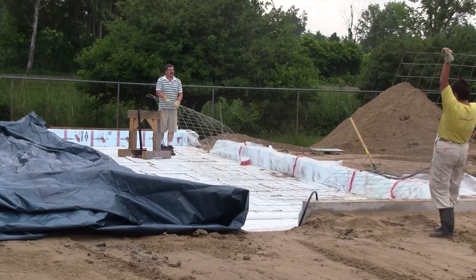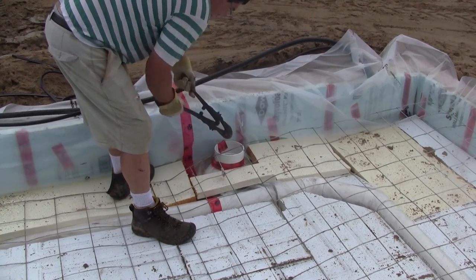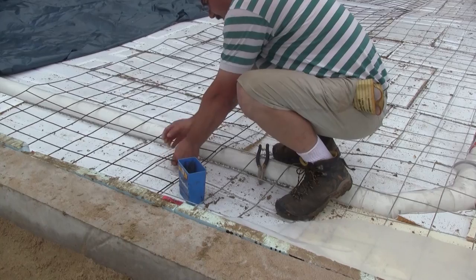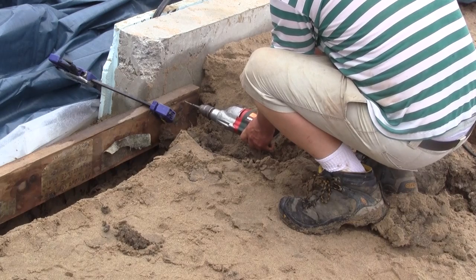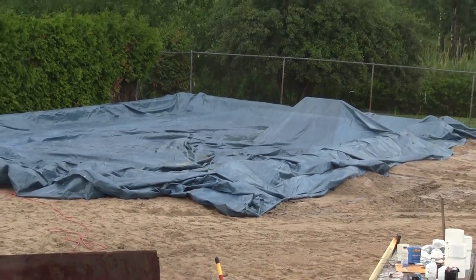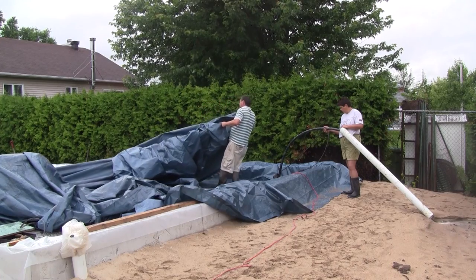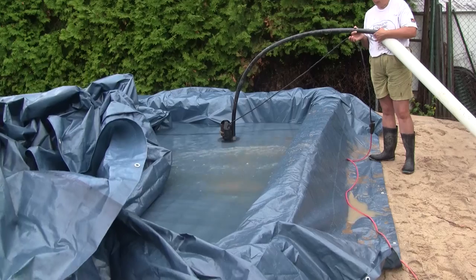The next morning, we installed the concrete wire mesh. I cut the mesh around each pipe and drain, then they were tied together with small pieces of wire. The last thing to do was to put some 2x8s in front of both door openings. Finally, we covered the whole shop with a big 40 by 60 feet tarp. Then the rain began and it poured cats and dogs for the rest of the day and night. The next morning I was very happy we had put this huge tarp over it, otherwise it would have been hell to get rid of the water between the vapor barrier and the door cutouts. We ended up pumping out over three inches of water and this took more than an hour.